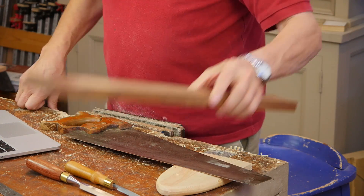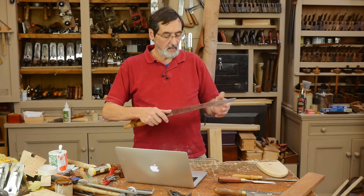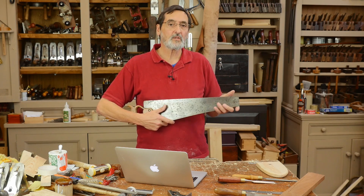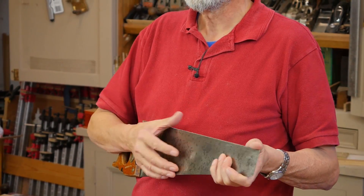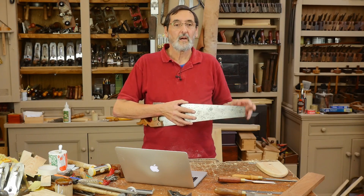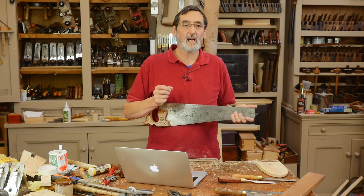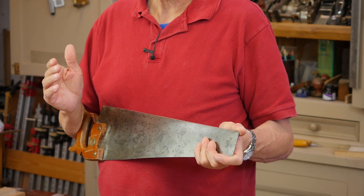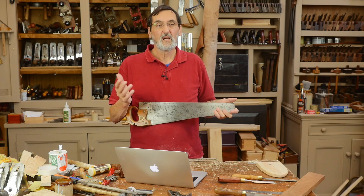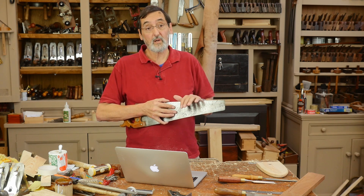Those are the tools you need: a plane and a hand saw. One thing about saws when you are rip cutting — if you're resawing, you need to use a rip saw, not a cross cut saw. That means the teeth are square across rather than pinnacle teeth. Also pick the right tooth size. When resawing I tend to go with a fairly large tooth size: six to eight points, or up to ten points. Ten points gets a little too fine for this type of work, and four points work well on heavy material — especially on pines.